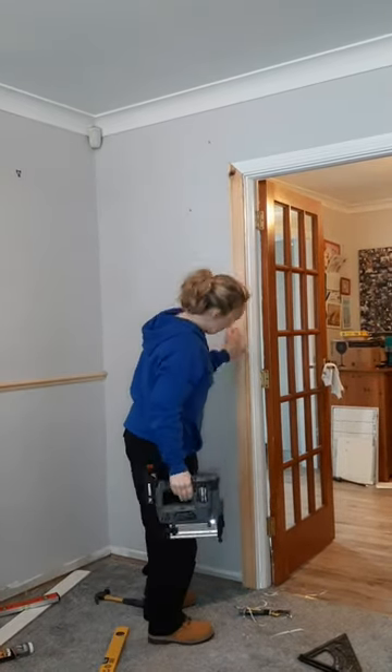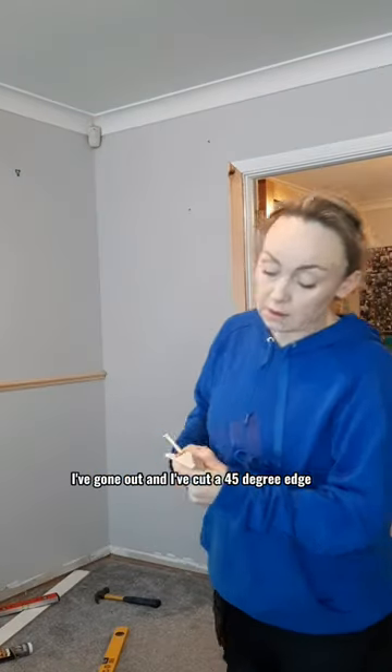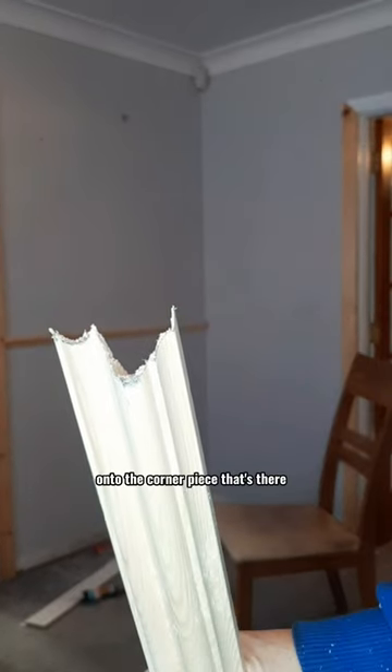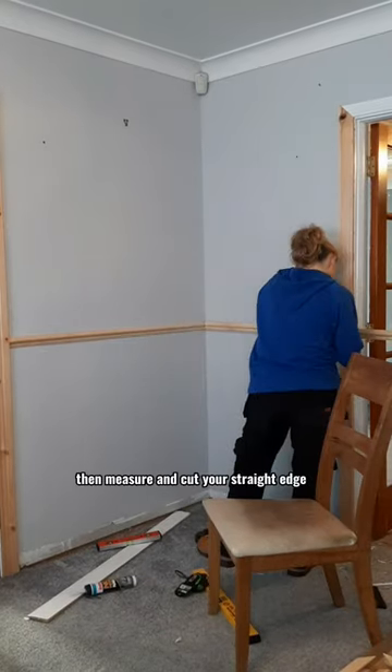Because if you take your time with prep, you'll get a much better finish. Once I have that tacked on, this is the panel kit that I'm using. I've cut a 45-degree edge and marked it out, then I do loads of straight cuts and cut that out. This is called scribing and it will allow it to fit much better onto the corner piece. Always do your scribed end first, then measure and cut your straight edge, and then secure that in place.